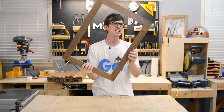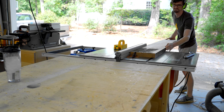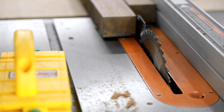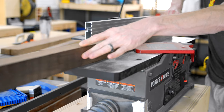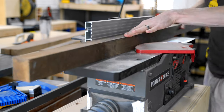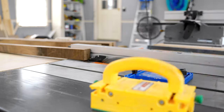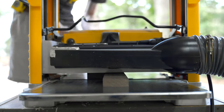We are working on tons of these walnut frames. To get to this point, I'm starting with a pretty stock piece of walnut that I'm milling down and cutting to size. The process is getting these down into strips about three quarters of an inch thick and about two inches wide. I'm taking it across the jointer to get two sides square to each other, then ripping it to size on the table saw and getting it to final thickness on the planer.